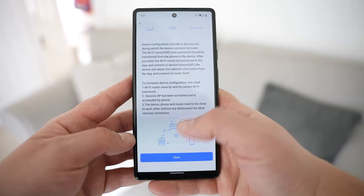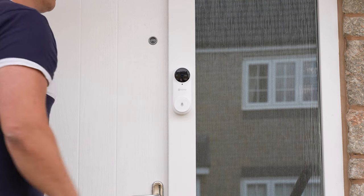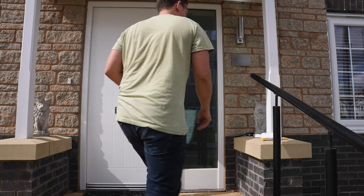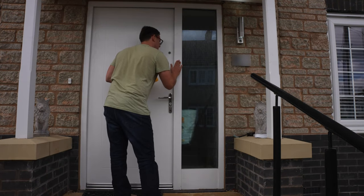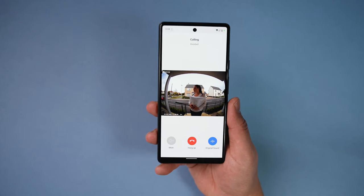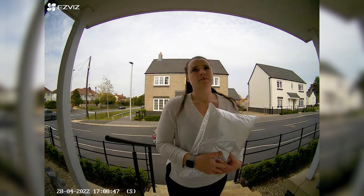For this review I've decided to test the wireless functionality, so I'm going to stick it in place with the adhesive pad and then mount it permanently after the review. It's recommended to install this at 1.2 to 1.5 meters high, so I placed it at 1.2 meters and checked the feed on my phone to confirm the height. We then placed the sticky pad on the mounting plate, lined it up on the door frame, and pushed against it to stick it in place. From this point the doorbell works with its pre-configured settings, which can all be customized.